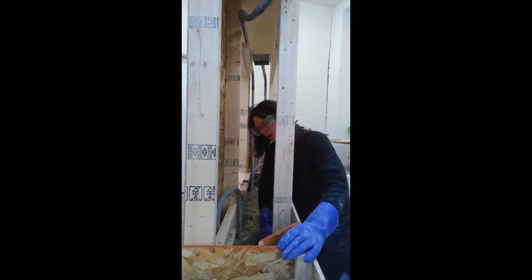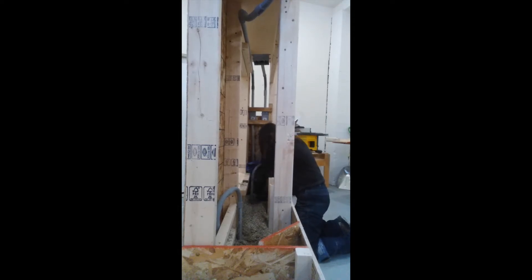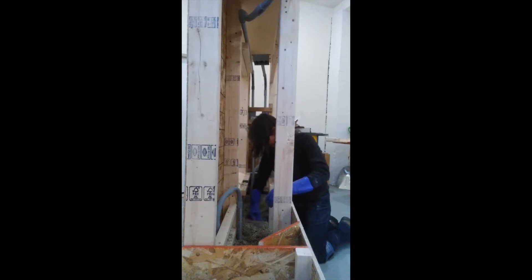Because I'm looking at the bottom of the wall, I have knee pads and I'm on my knees. This will only happen for a short time in any wall, so enjoy it while it lasts — very little bending down. You'll notice that the formwork is OSB; it could be plywood, but you just want something thick enough that it doesn't deflect while you're installing the hempcrete.